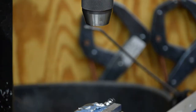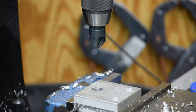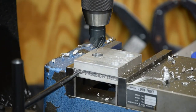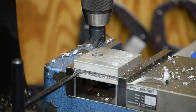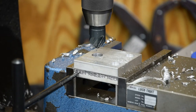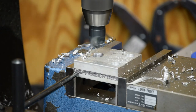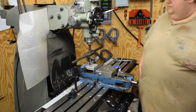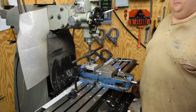Maybe we'll put a chamfer on there. Now we go back up with the knee. We've got a nice big chamfer on there so it's easy to start. Alright guys, I've got my hole drilled out and chamfered and I'm ready to tap it now. This is the on-camera debut of my prototype big boy tap guide.